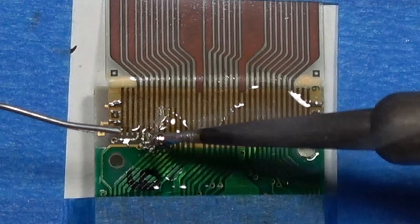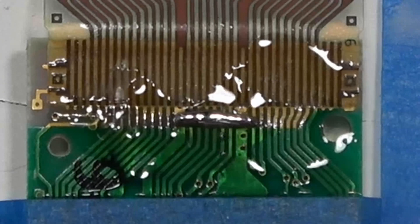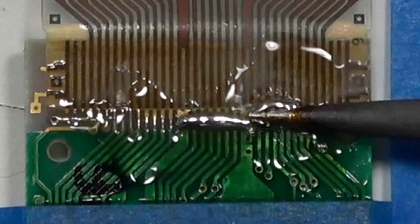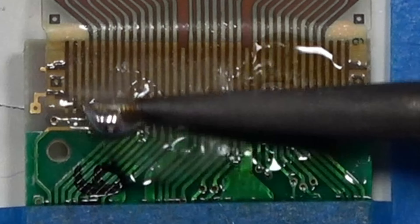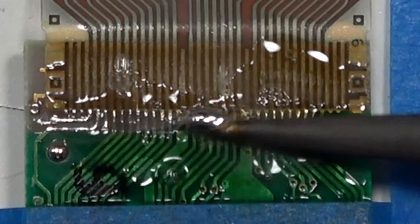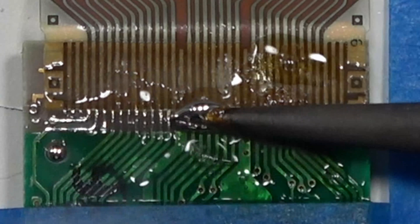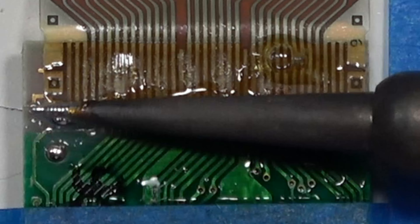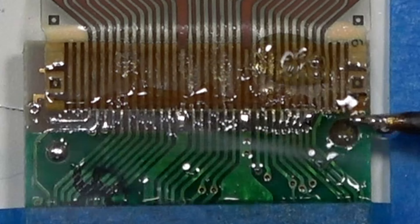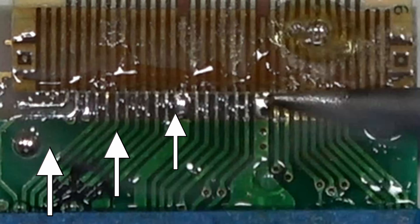On the bottom pins you can see they're different from the ribbon cable pins. I only like to move horizontally when touching the bottom pins. If you move horizontally on the ribbon cable pins you can shift those pins out of line, so be very careful not to move those horizontally. However, it's really nice to tin horizontally on the bottom half — getting the bottom part tinned is our main goal right now.